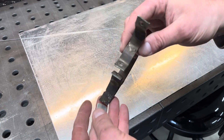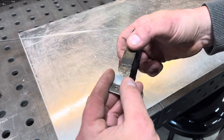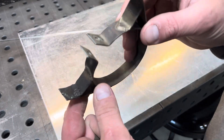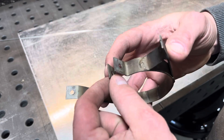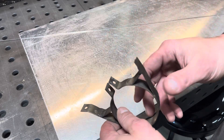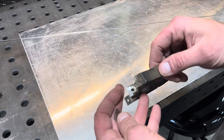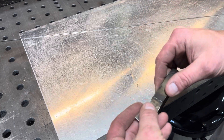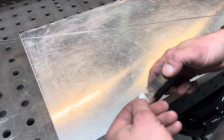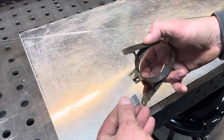I'm not sure of the grade of stainless, so what I'm going to do is weld it with 316 filler wire. I don't have any way of testing the grade of stainless besides a PMI gun where you shoot it and it'll tell you exactly what it is. But I've had good luck when I didn't know what something was either welding it with 316, using an Inconel 82 wire, or some guys swear by 309. For this application we're just going to use 316.